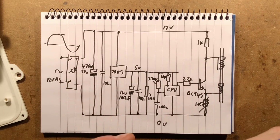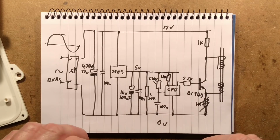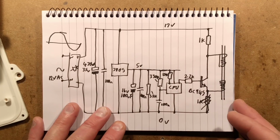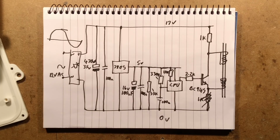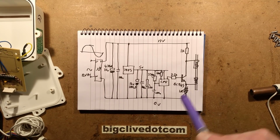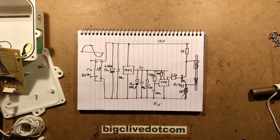And it's sweeping a frequency, so that ticks the box for the tuning to whatever the frequency of the contaminants in the water is. And that just leaves you to make the decision then, whether you think this is real or not, based on that circuitry, because it really is very, very simplistic. My own impression is that I would not waste my money on one of these personally, because I don't think